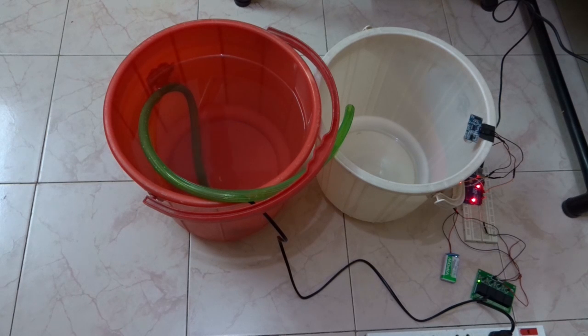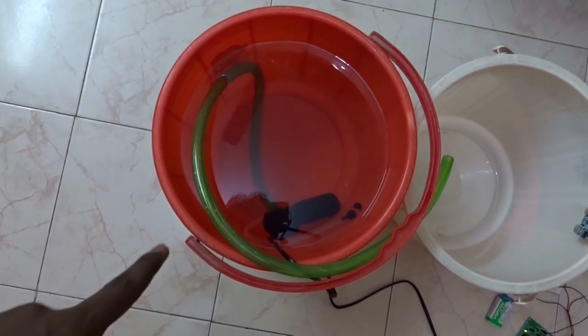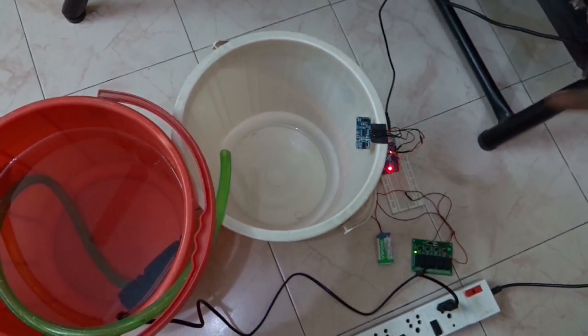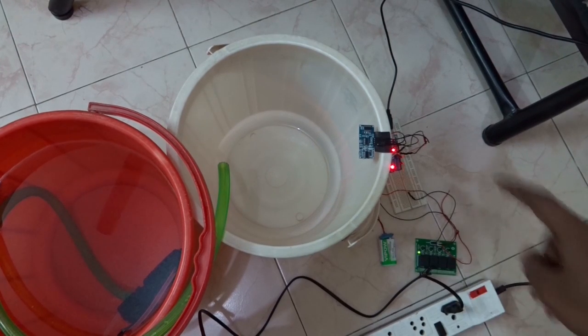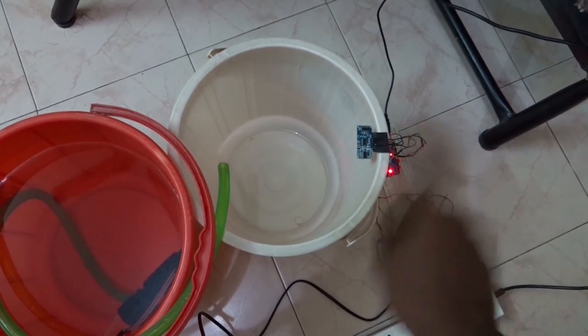Hi, in this video we'll see how to make a contactless water level controller. So here you can see that I have placed my motor in a tub. This is a submerged motor, and I have connected an ultrasonic sensor that is going to measure the distance. You can see here it's empty, so whenever the tank is empty it starts to fill